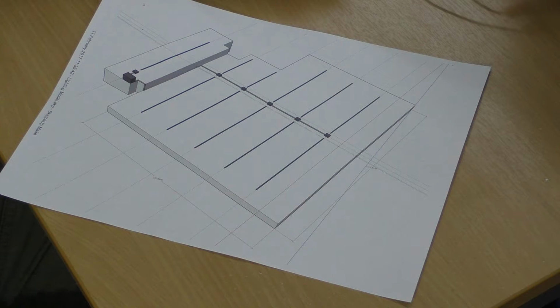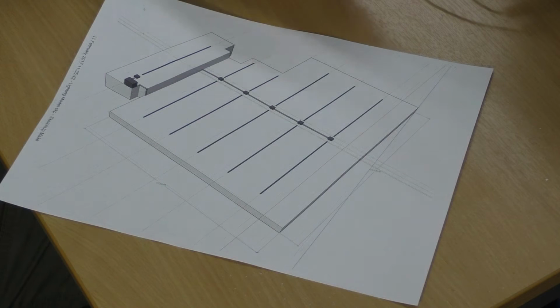Now, the next problem is actually providing 12 volts DC. If your LED ribbon is sitting right next to your bench power supply that can provide 12 volts and however many amps you need, then everything's easy. In reality, that's not the case. In reality, your LED ribbon is on your ceiling, and it's often quite a distance from the power source.